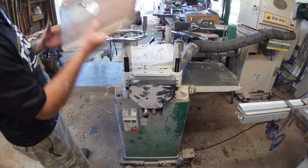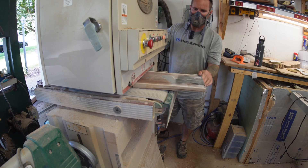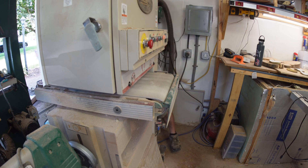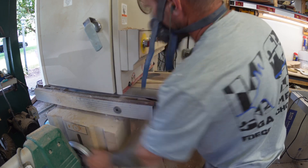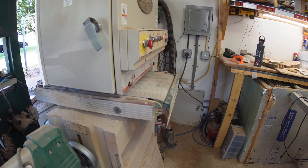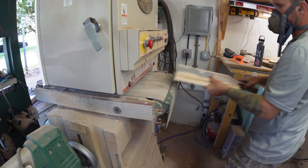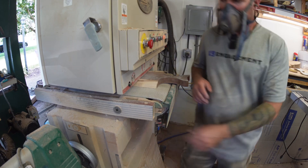After planing, I like feeding them through this wide belt sander. This does a great job of just making the boards perfect — it gets rid of any little wobble, takes out all the bumps and imperfections, and makes it perfectly flat. It definitely takes some time; it doesn't move real fast, and depending on the board it might sit here for several minutes feeding through. But it's totally worth the investment in time — it gets the boards just perfect.